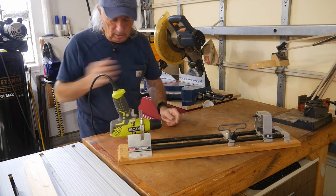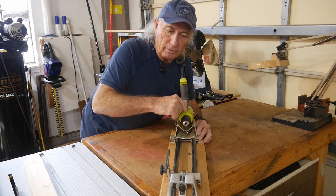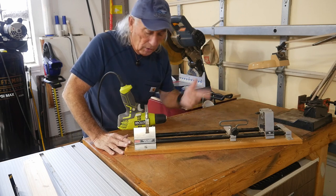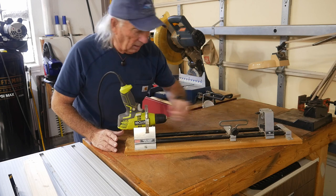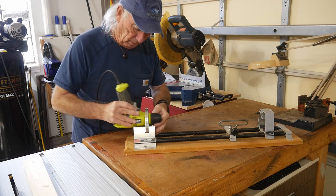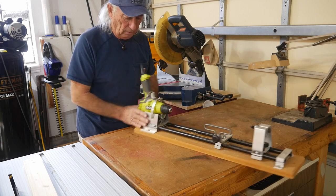Because of the V-block, we have two issues. The first issue is you want to be in line from here to here, but the second axis is going to be from here to here — this way. I dug out a piece of doweling to go from here to here so I could sort of see if I can get the centers lined up pretty good before we try to see if we can get this thing running. I've already adjusted this screw a little bit, so I think I've got the height. Ideally, because of that straight line you want, I'm trying to get the drill reasonably straight up and down, and then I'm going to lock it in.